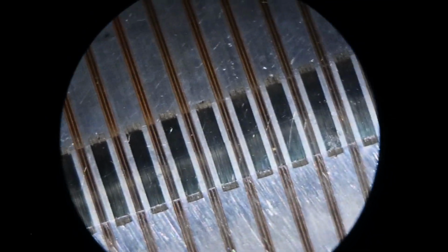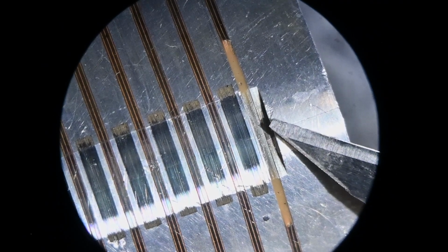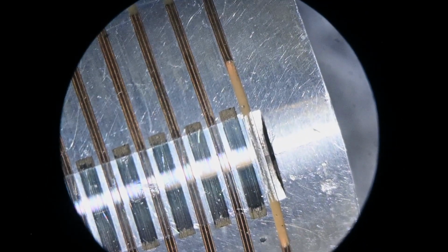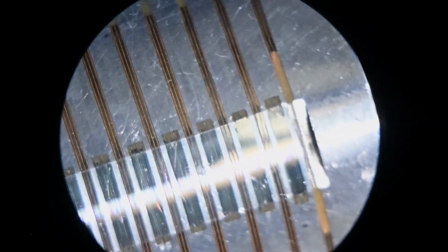Here's another example of a worn out head, 24 track. You can actually see the gap without magnification. This is actually visible to the naked eye. These are wear grooves. Very good idea to keep the edges of the tape from curling up while it's wearing. And when that wears down to the width of that wear groove, they're done. It's time to change them.